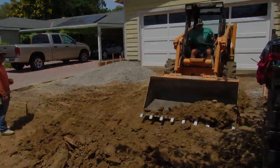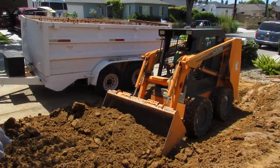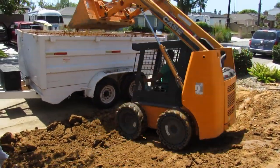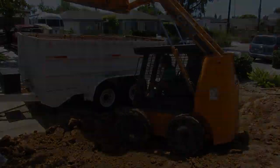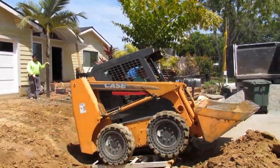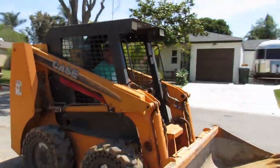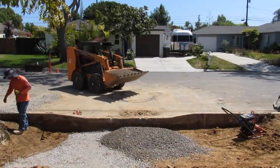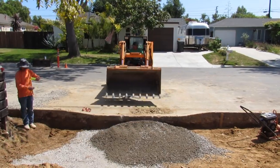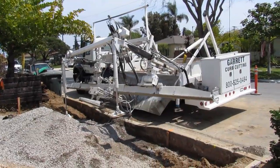My friend Richard was back-filling his pool about a mile away, so I was just round-tripping the dump trailer a mile and dumping it in his driveway. This thing's got plenty of reach — I could easily do it from down below and not come up and down the curb. You can see how steep it is; I had to go down 12 inches, so I put my ramps to get out of there. I had to put some dirt on the street. The city calls for six inches of road base compacted at 95% and then six inches of concrete, so it's 12 inches down.